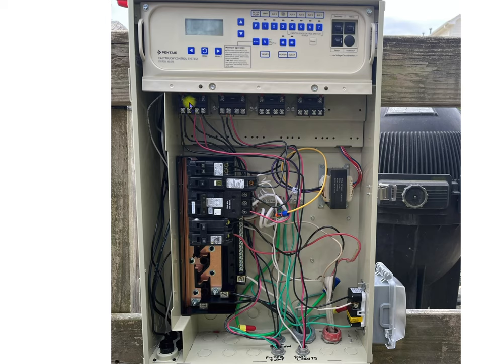If you set your low speed to roughly 1800 RPM or 30 gallons a minute, that salt system is always on. You use your features or other auxiliaries to run the pool at a high mode — in the morning for high flow to clear dirt off the top of the pool, or spa spillover at night at a much higher speed. If waterfalls or other features are active, those are at higher speeds. The higher speeds take priority over the lower speeds, so the highest speed will always take precedence.